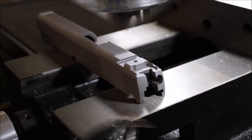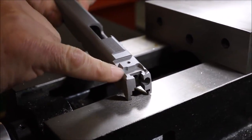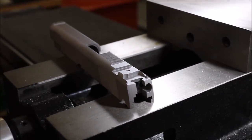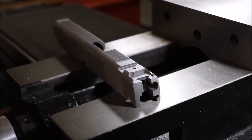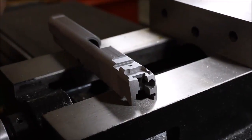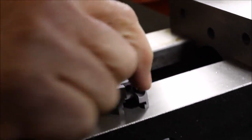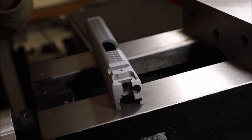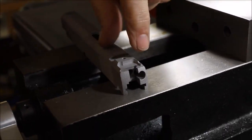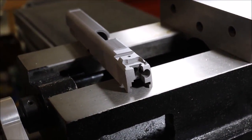Just to give you an idea of how intricate this cut is — this is the whole profile of that cut, the dovetail and the pocket. Now when we first started shooting the combat action sports, IPSC and all that, this part back here was just cut straight off. But somebody figured out a way to machine that pocket in, and it gives the slide just a beautiful cut and a protected side. We'll also make this little cut here that gives you access to the windage screw.